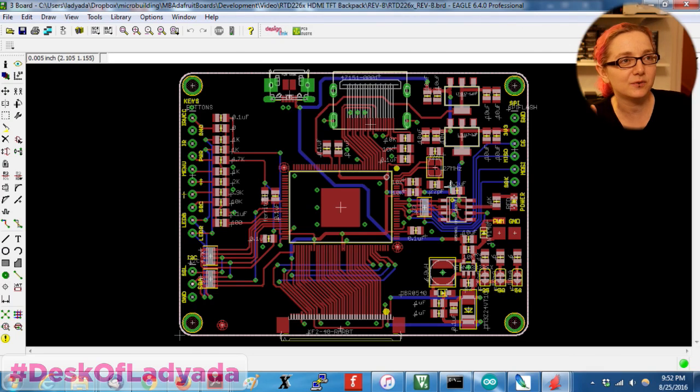And the next step is, of course, figuring out the firmware, because the default firmware is okay, but what I really want to do is configure different size displays, and you have to actually hard code the display. So maybe next video or in a later video, I'll show compiling with Keil, which I've never done. I got a copy of Keil 51, and setting up the pixel sizes, the horizontal and vertical, to use with a custom display and wiring it with a custom display.